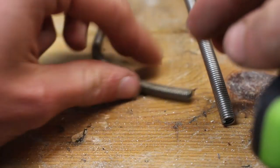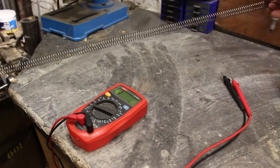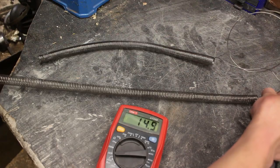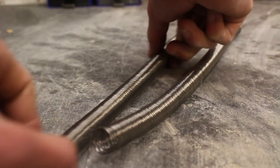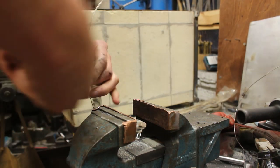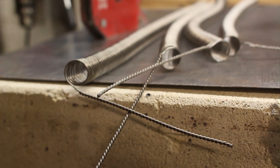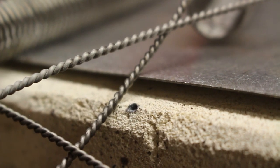I want these elements to last as long as possible and that's why I'm making them out of Kanthal and not nichrome. Nichrome has a lower operating temperature and a shorter service life. I deliberately wind my coils too long and then slowly unwind them while measuring with an ohmmeter to see what resistance they are, aiming for 15 ohms. It's very important that the coils have similar resistances because if one is higher power than the other it's going to cause uneven heating and uneven wear on the coils. To make nice neat ends I fold the coil back over on itself with about a 10cm length, hold one end in the vice and the other in a drill chuck, and just spin it until it's all nice and twisted together. These twisted ends are much better for attaching to terminal blocks since they're a much lower resistance and won't heat up as much.